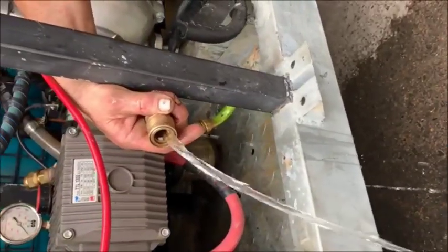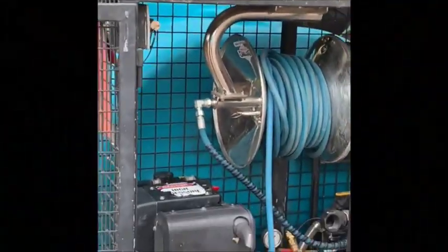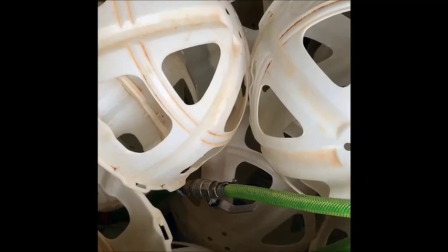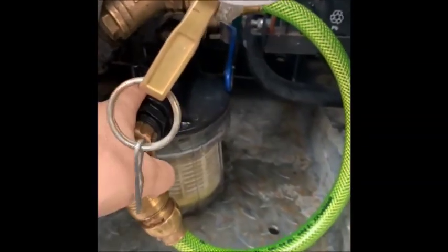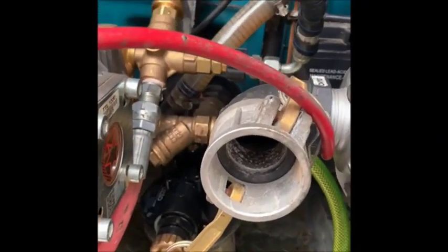When you lift it up to that height it doesn't actually suck water in. So now we've filled your tank — we filled it to quite close to the top. I'd say we've got maybe 1200 liters in that tank now. We start again and it makes a huge difference because of the weight of the water pushing through gravity. Note that we have two strainers on here: this large one down here, and then another restrictive strainer in here, so that small amount of water getting to the pump is going through a strainer.